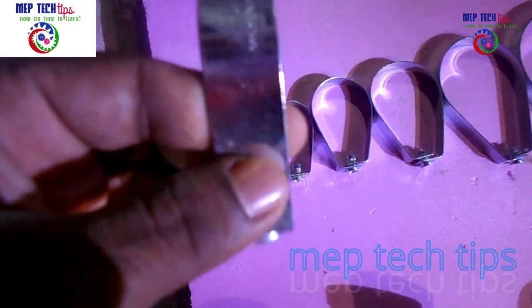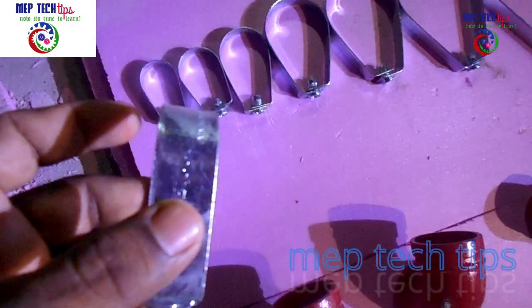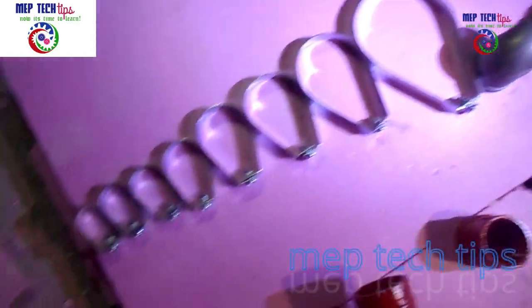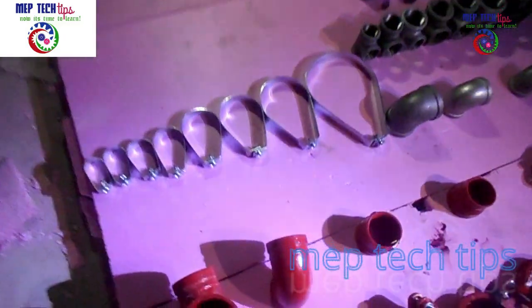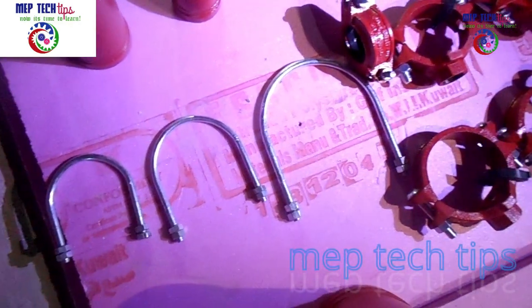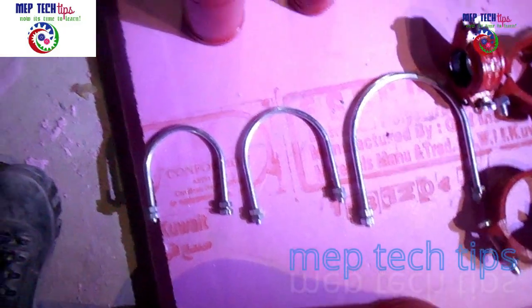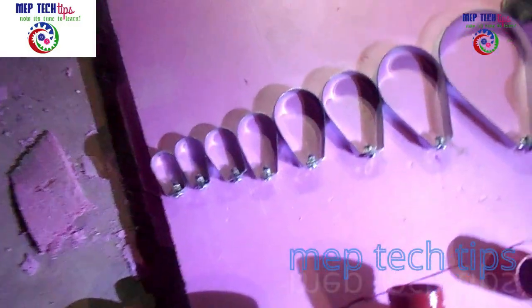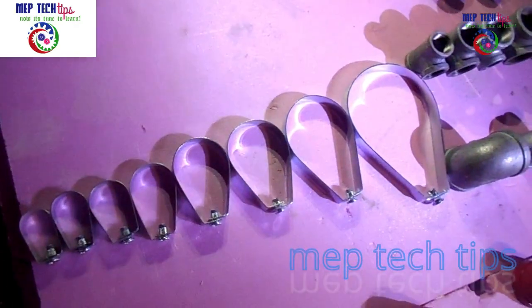You can see in my hand there is a sprinkler hanger — one inch. This is available from one inch to six inch, and this hanger is UL listed. UL stands for Underwriters Laboratories. It is a product safety testing and certification company. A representative sample of the product must be tested and must meet safety requirements to get the UL listed mark.